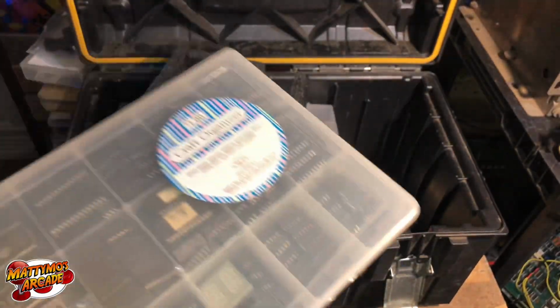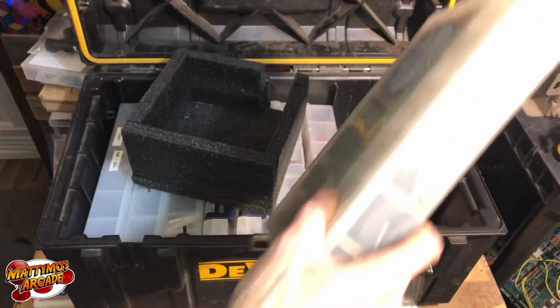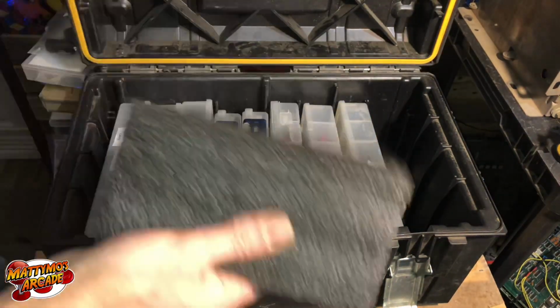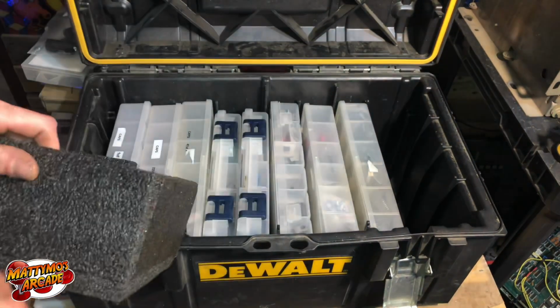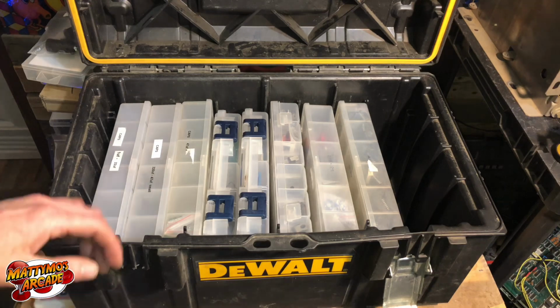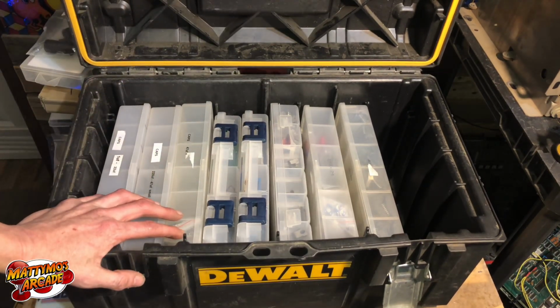I just got that programmer recently and have just been able to start verifying our ROMs and burning them when we need to, which is a huge part of it. One ROM with one corrupted file will keep you from having your gameplay. Not every time, but sometimes. And in that situation, there's no amount of turning screwdrivers that's going to help you get the game fixed. Once you get it set up on your computer, it takes just a few minutes to fix the ROM, and it's just been night and day difference.